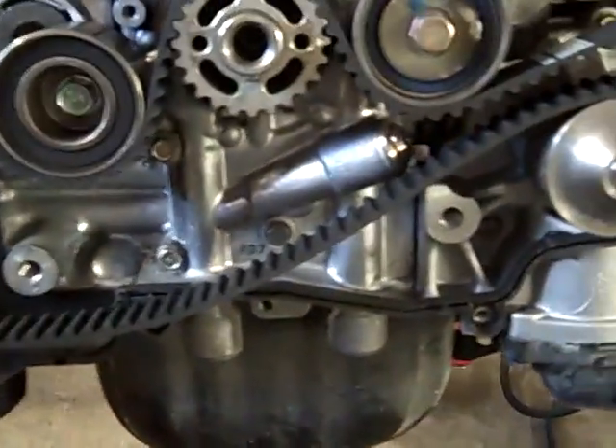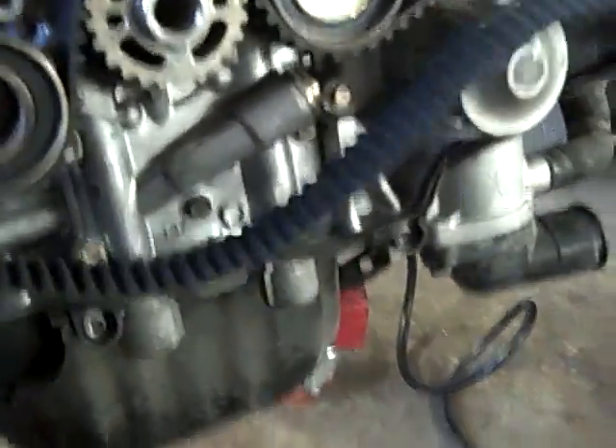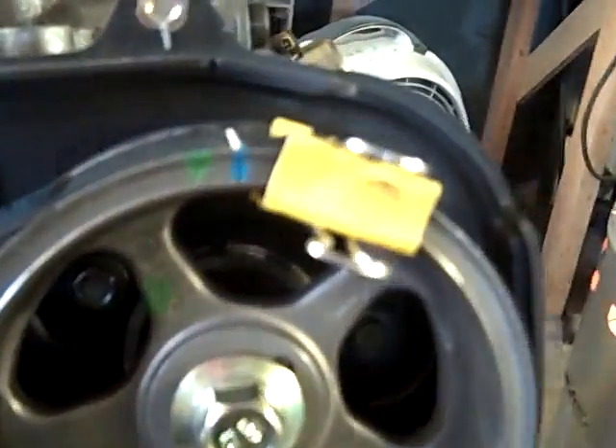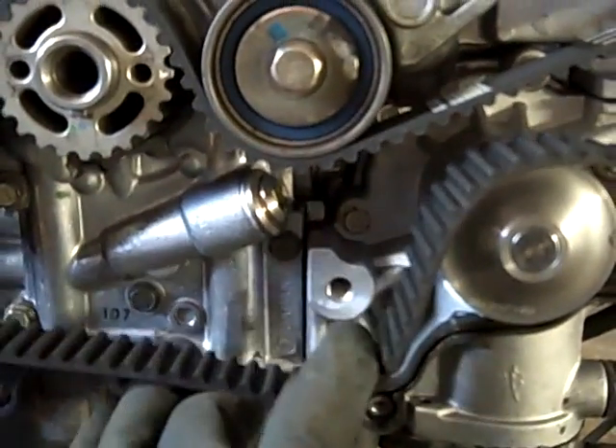It'll pull the slack out later. You can see the white marks that come with the belt and the arrows that are on it point to the right because it's a clockwise rotating motor — that's basically how you line those up. You'll notice that I'm missing a pulley here on the tooth side and also missing a pulley here on the smooth side. I'll install the tooth side pulley first. Having that one over to the right enables you to get the tooth side one on first.